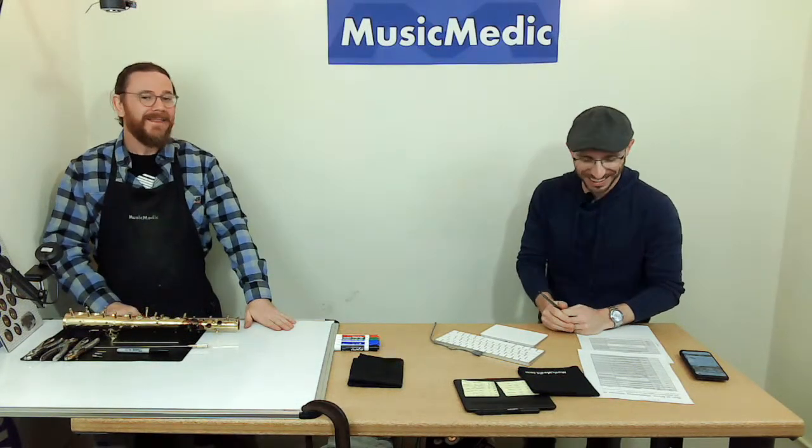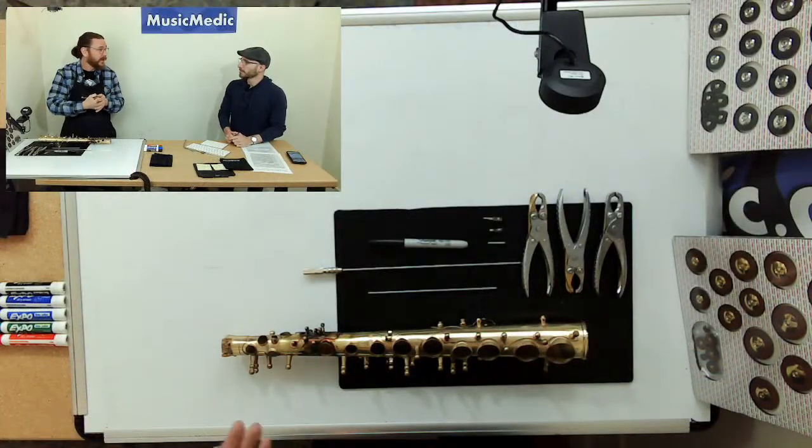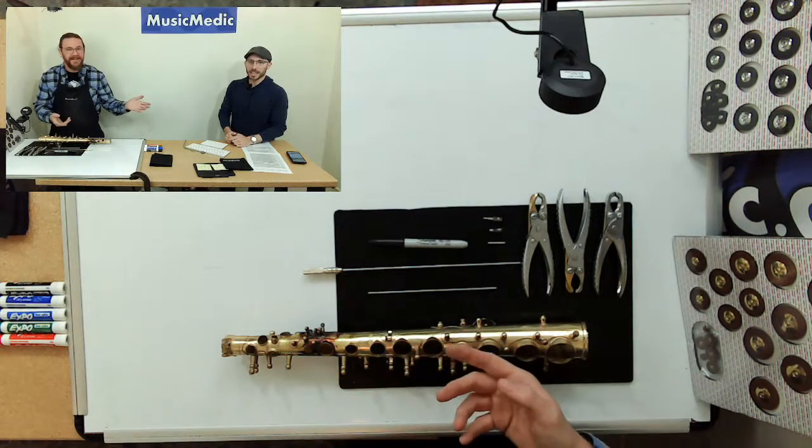Facing and fitting is one of the first stages of precision key fitting where you're prepping everything. You do this even before sweating. The very first thing is you've got to get your posts into general alignment, then you do your facing and fitting, and then you might have to tweak things. Facing prepares the space in between posts to be nice and perpendicular to the hinge tube.